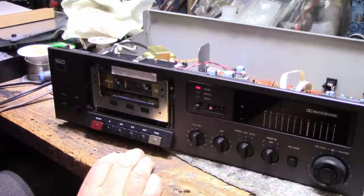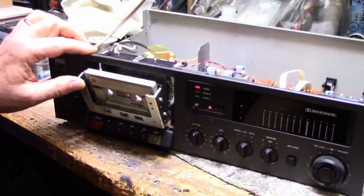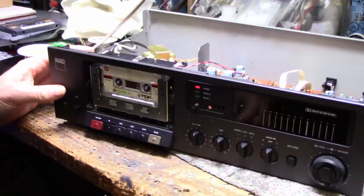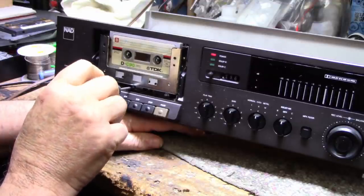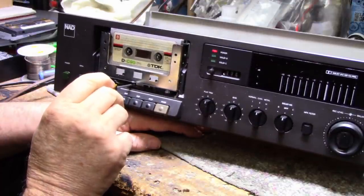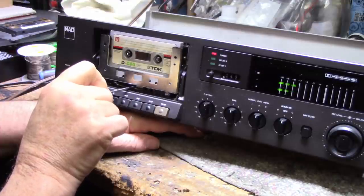Okay. Stop this. I have another tape around here, the 7 kilohertz test tone. I'm going to put that in first, and then I'll get adjusting before I do the 14 kilohertz. Okay, here's 7 kilohertz. Now, how bad is it out? This good news, it doesn't fit very good. Let's get a better one. Okay, right about there.